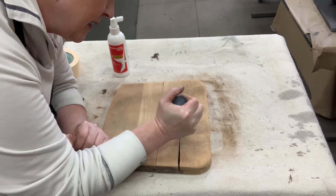So Chris is going to remove the wire that was used to hang it. It's very aged. I wouldn't want to trust it too much if we're going to put some heavy mirror in there. And then I'm going through. It still had some of the glazing points in it, along with these little pieces of wood that helped secure whatever was in the frame to begin with. And we're going to be removing those so we don't accidentally hit anything that's going to prevent the new mirror from going in, breaking. Going to go ahead and line up the one corner with the mirror and then take a Sharpie on the other side to make his marks of where he needs to make a straight line to cut the mirror.